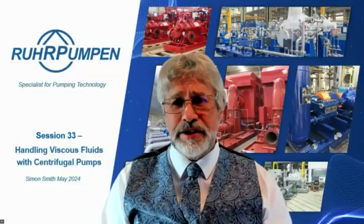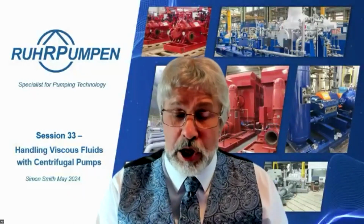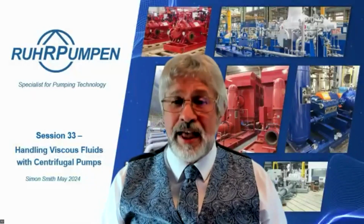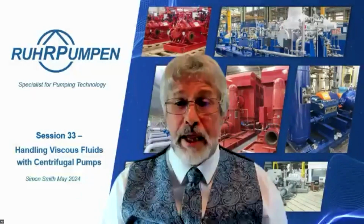Angelo Mendez says, what would you recommend in the case of a parameter B higher than 40? Change to a higher model capacity or change the technology? I have played with parameter B by plugging in different values of flow and head and viscosity and so forth into my little calculator. If you've got a very high value of 40, it's probably a very small pump and high viscosity. And we saw that small pumps tend to be a low specific speed, around about 500 in US units. So the smaller the pump, the less flow, higher viscosity. That's when you get factors of B above 40.